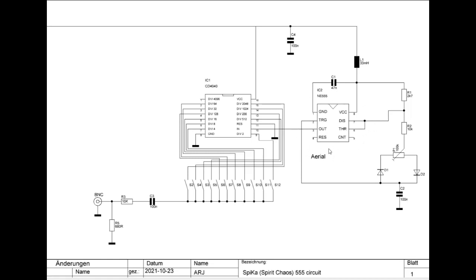My fault was just that pin 6 originally should be connected to pin 2 and I accidentally connected it to pin 7. And suddenly this NE555 showed absolutely strange behavior — it produces sounds I never heard before. The crazy thing is that the NE555 in astable mode is only capable to produce one frequency at a time. But what I heard was the combination of tones — obviously more than one frequency at one point in time. I asked myself, how is this possible?